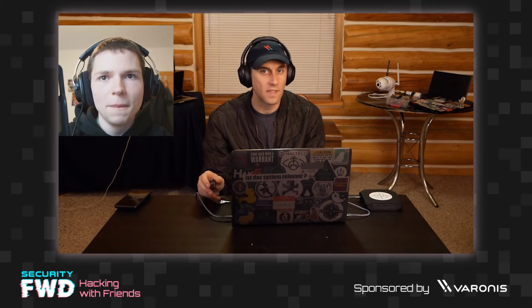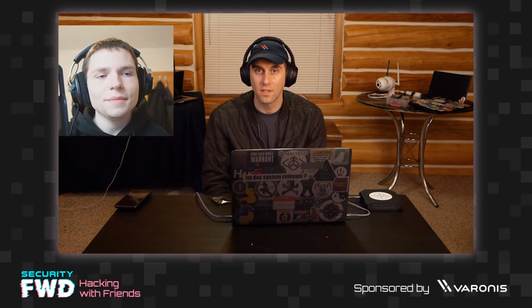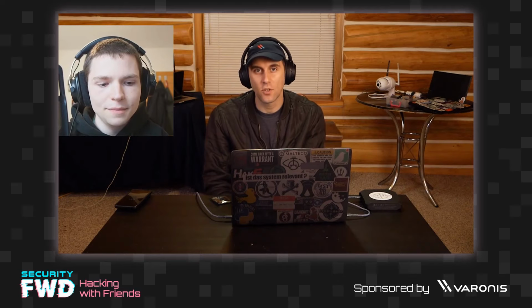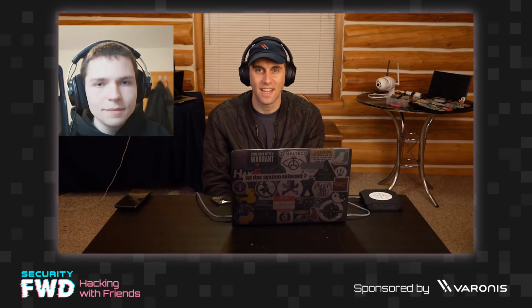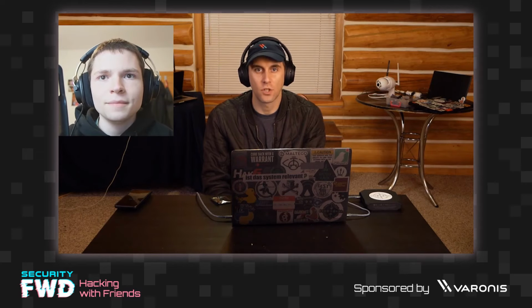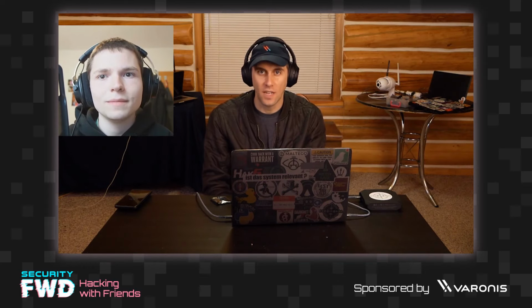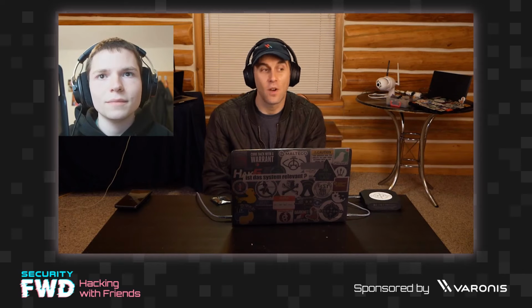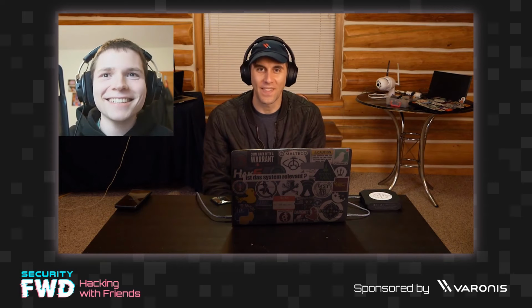So, yeah. Now, that doesn't mean it's totally useless, though, because I know that you've built a couple projects based off of this ability, and it seems like you're still able to detect problematic packets like a deauthentication packet, which gives rise to the deauth detector, which is an ESP8266 based project that just sniffs for deauthentication frames, or does it look for disassociation frames as well? No, I added that. I think I forked it and just added that one thing.